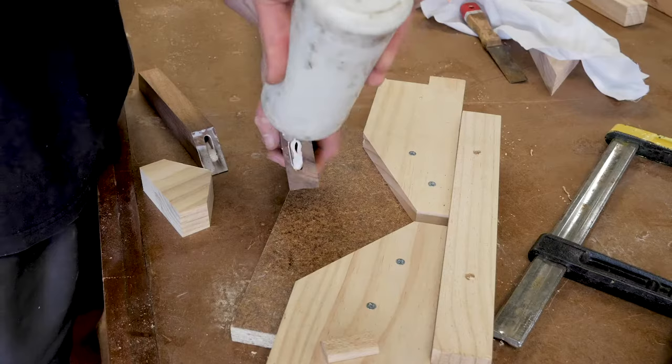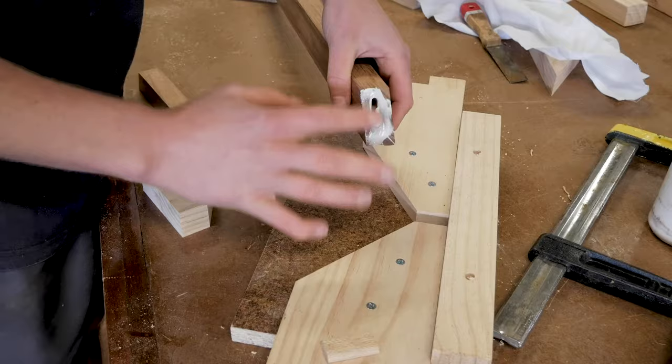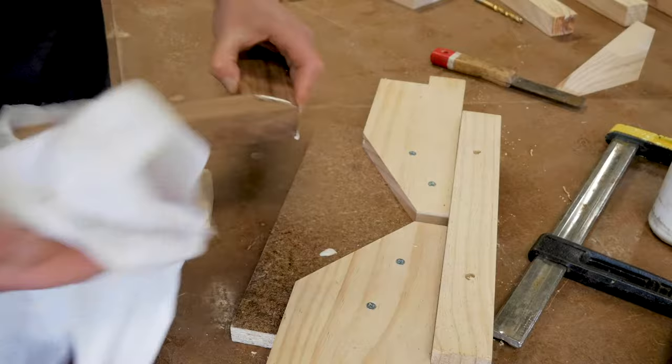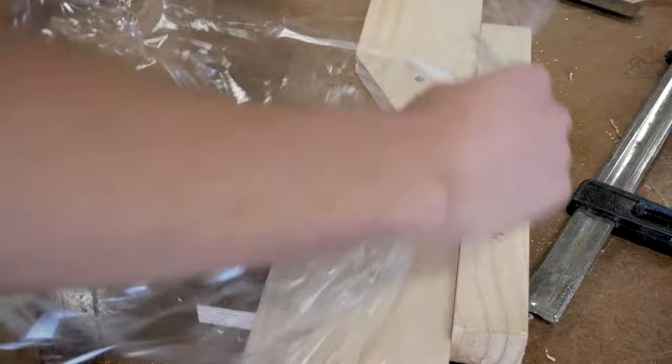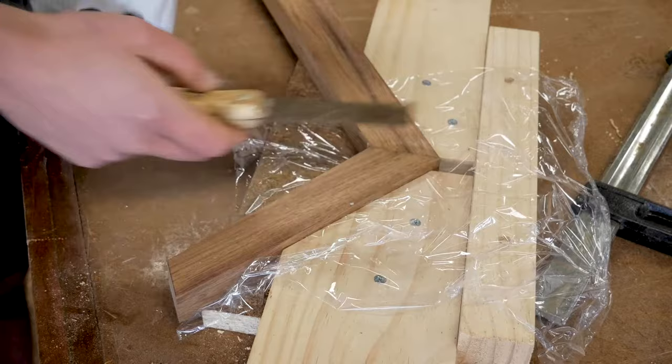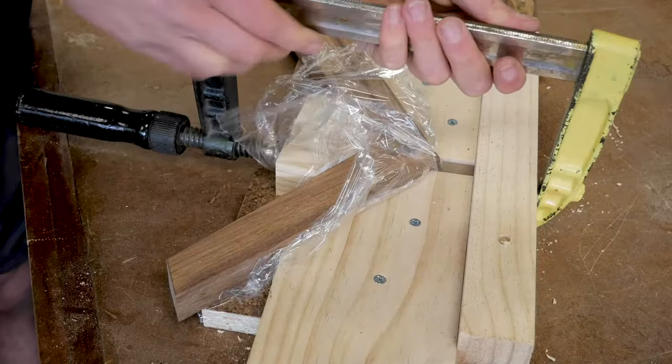This joint is just a domino, but you could use dowel joints, pocket joints, or anything like that. I'm going to be using reinforced splines on this as well because it's going to carry a lot of weight. To make sure your timber doesn't stick to your jig, put a big piece of cling wrap in there — PVA glue doesn't stick to cling wrap, so that'll protect your timber. Make sure you scrape out any squeeze out prior, just to help with cleanup. As you can see, parallel force going across.